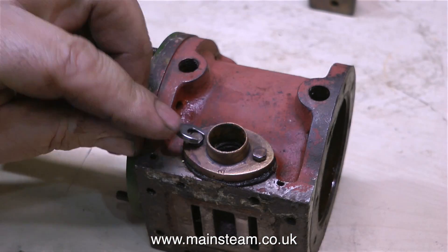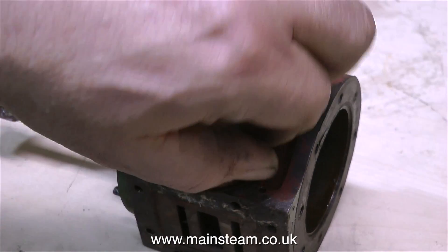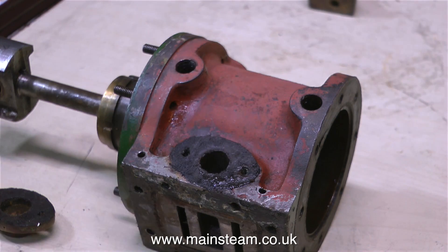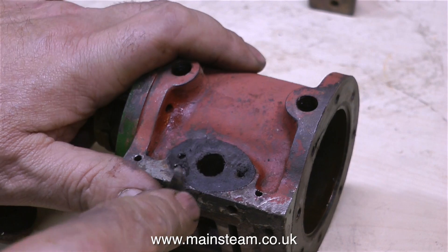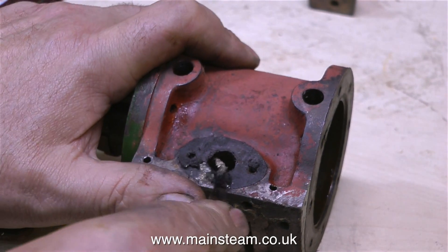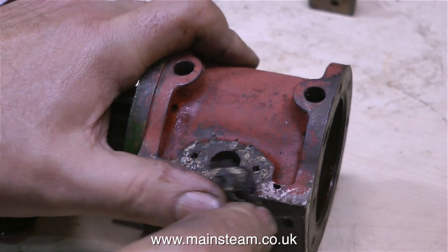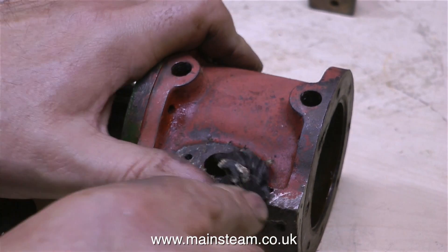In this clip I'm removing the next-to-useless exhaust manifold. I don't quite get this — it's just a very large orifice. The part isn't threaded, so I don't know what the plan was with this engine or how the pipe fitted to it. But what I'm going to do is plug up the hole, then silver solder a piece of phosphor bronze into the large opening, and thread this half inch by 32 threads per inch. And that way I will be able to screw in an exhaust pipe fitting.